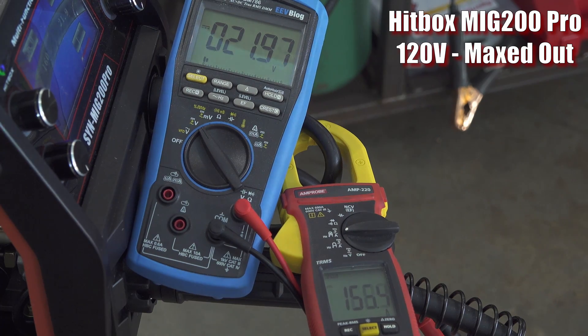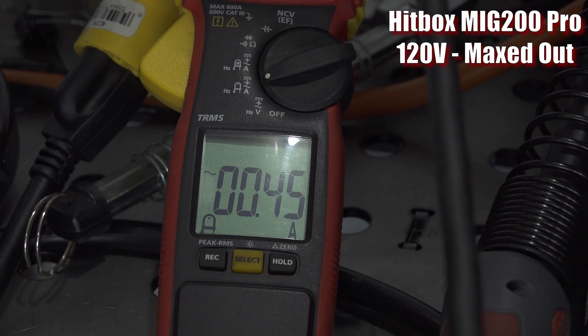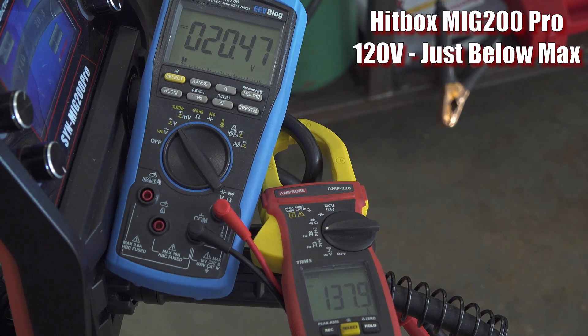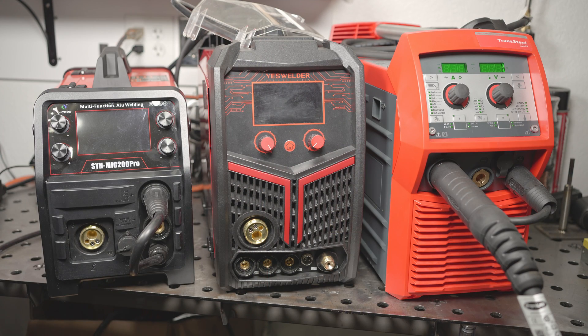It had cut out on me a couple times. The machine didn't turn off, and I could immediately start welding again when it happened, but it's still not ideal. Also, it draws 50 amps from the wall at these settings — not very practical for the circuits most people have in their homes. If you turn the settings down just a bit, it still welds nice, doesn't kick out, and puts out around 2,800 watts. At these settings it draws around 38 amps. That's still a lot, but it's a bit less likely to result in a tripped breaker, at least for short welds. 38 amps will still trip a 20 amp breaker before too long if you weld continuously.